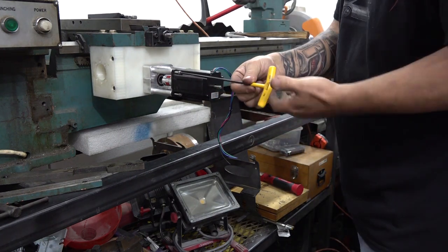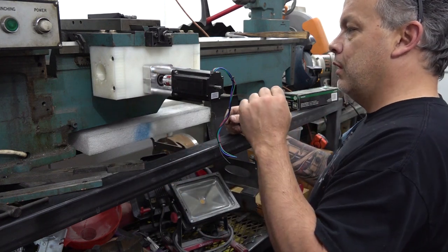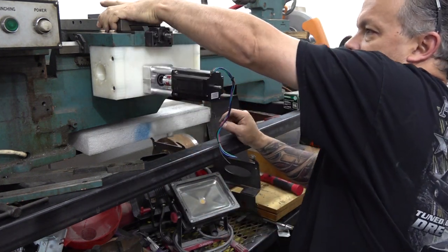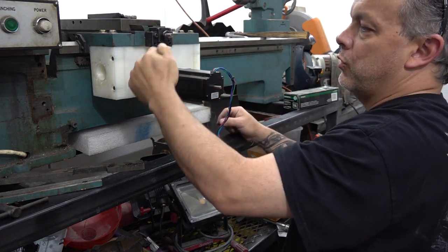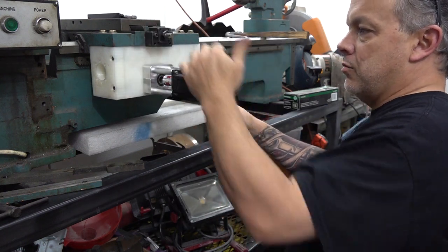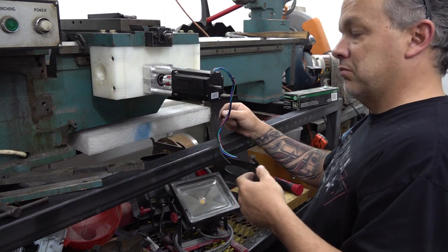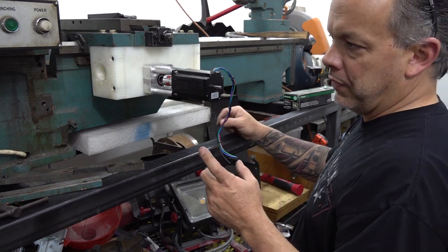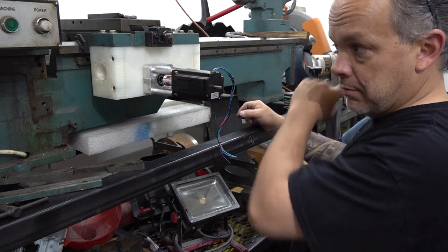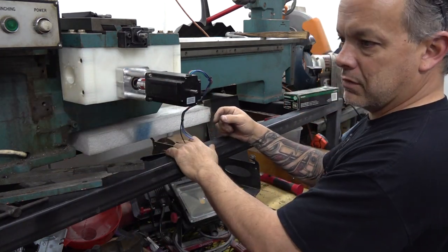Let's get the motor mounted and see how it all looks. This spacing is just the setup it had before when it was mounted up here, but I moved it down to give the cross slide some room. The way it was mounted before, the cross slide would hit it if it came back. So I moved the motor down and we'll put timing pulleys and a belt on it and see how that does. Next, we'll put the z-axis ball nut mount on both ends and make sure it lines up — when this thing is slid all the way over, that ball nut should line up pretty good right there.